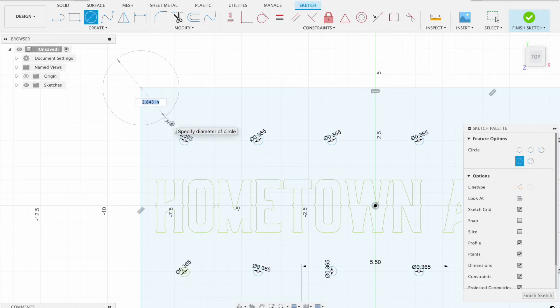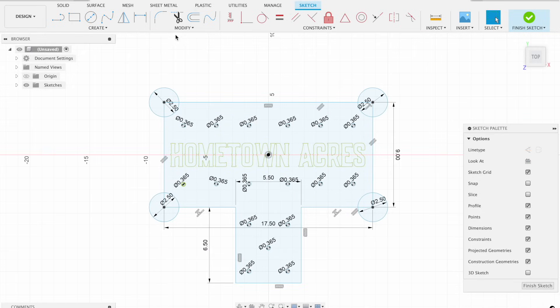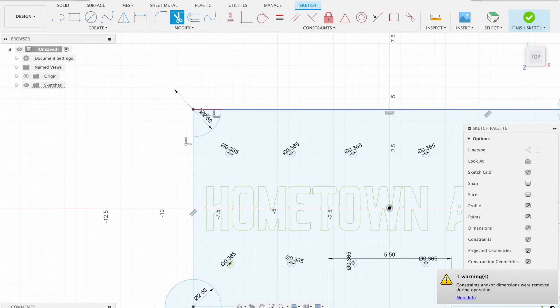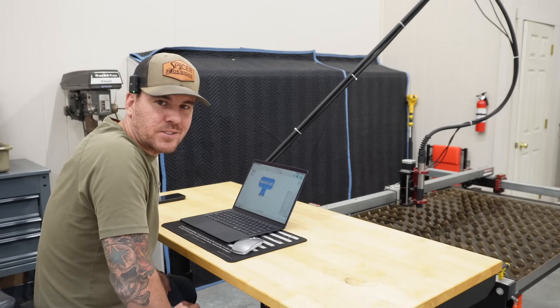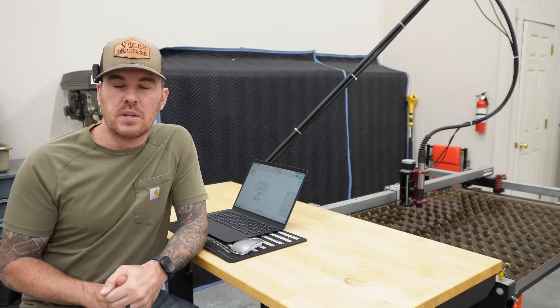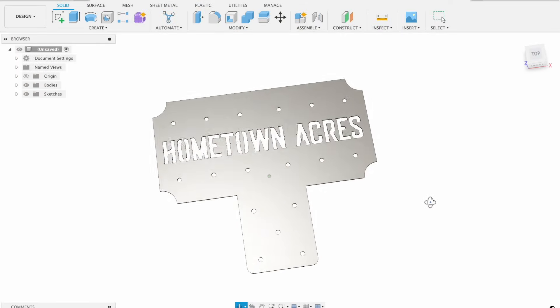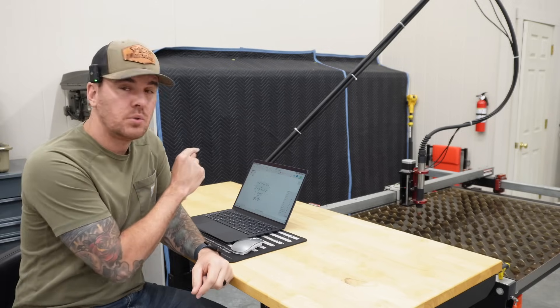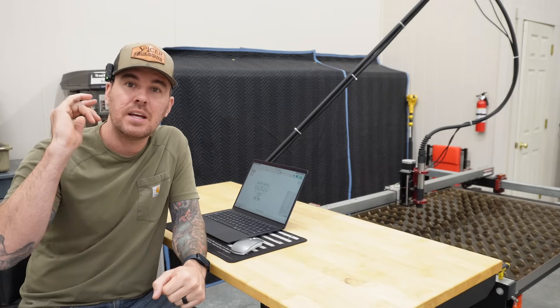I just want to go ahead and notch some of these corners so they look somewhat decorative. We'll go with a two and a half inch radius. I know that looks a little odd, but we're going to trim out these sections. Not crazy about it, but it's not going to be at my house. So that is pretty much the design part. I'm going to add a couple of bridges, then turn that sketch into a body, which helps in the manufacturing process where I create a cut path. I have videos covering all that — links in the description. Otherwise, I'm going to work on the two other right-angle brackets, then we can get some steel on this plasma table, get these things cut and painted, and get ready to head to Pennsylvania.